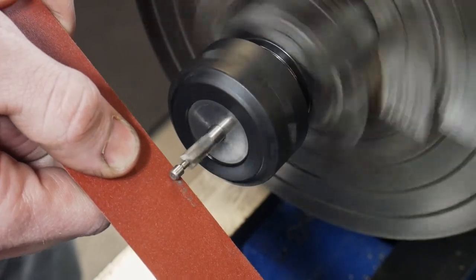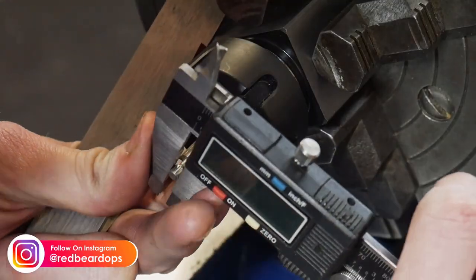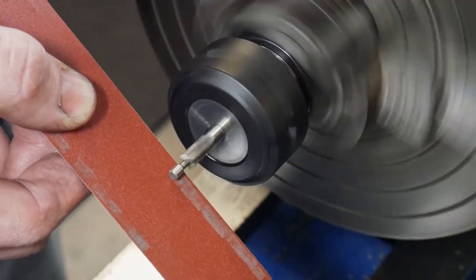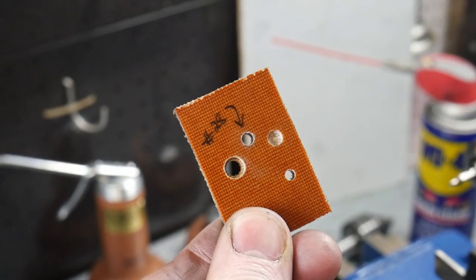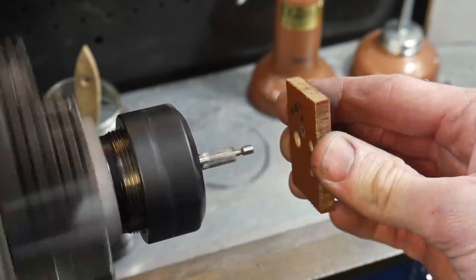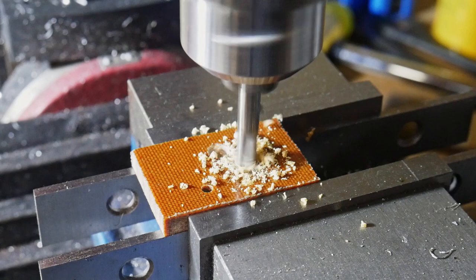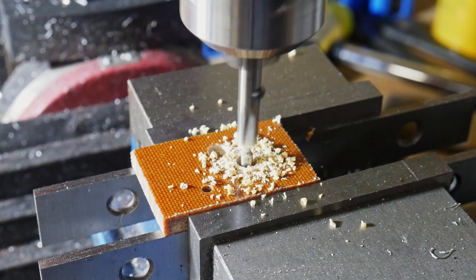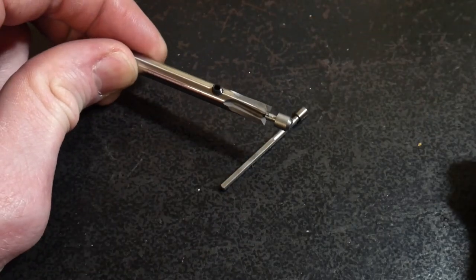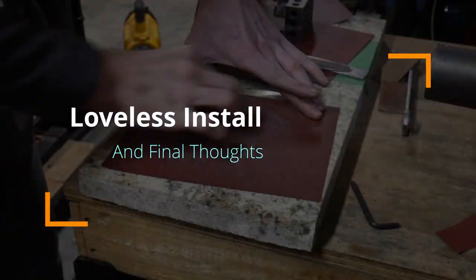My first thought was to turn the pilot down on the lathe, however I was not able to get a rigid hold on it, so I took a piece of sandpaper and about two hours of my time and slowly took the OD of this pilot down until it was a perfect fit with a number 28 hole. If you don't have a lathe for this operation, the same thing can easily be done on a drill press. I am a huge proponent of this counterbore from McMaster — I love that you can use multiple pilots with different fasteners. If you're only going to be using Corby fasteners, a good secondary option would be the counterbore from Pop's Knife Supply.